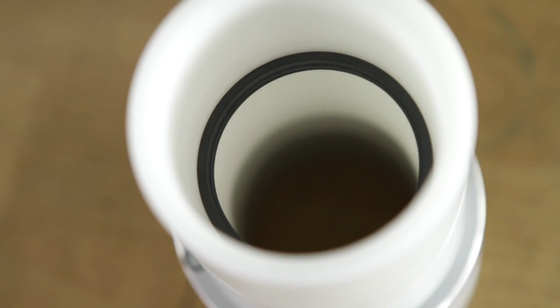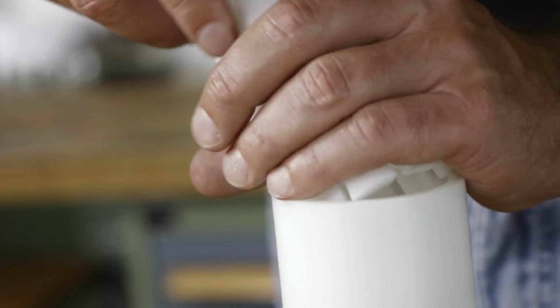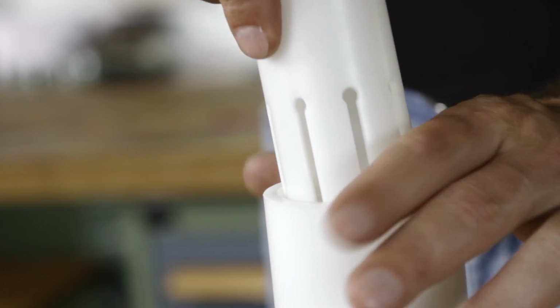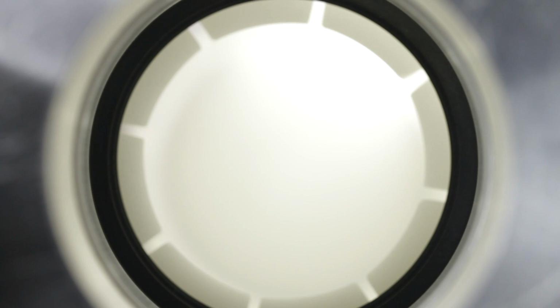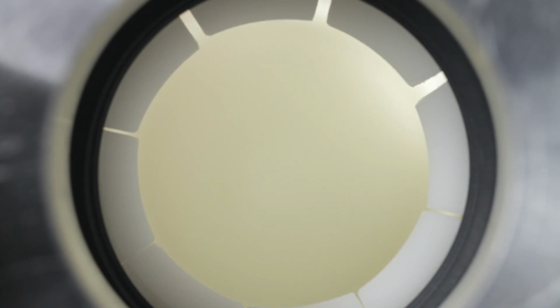Insert the Turcon rod seal into the assembly cone. Position the pusher tool above the seal. Push the seal slowly through the assembly cone until the pusher is at the stop point. The Turcon rod seal snaps into the groove.